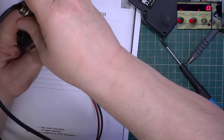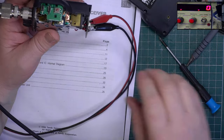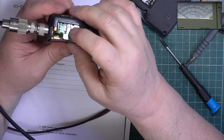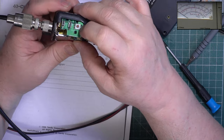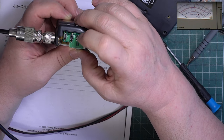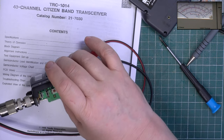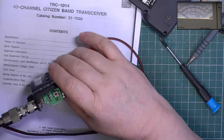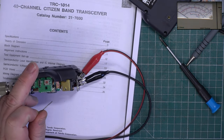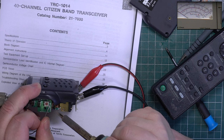I'm not bothered what channel it's on - it's just a matter of trying to see what's happening with the PTT switch. I'll put the picture-in-picture onto the main meter so we can see it going into transmit. You can see I press this and it's pretty intermittent. So I'm going to have to replace that switch by ordering one - and I bet I've got to order 25. So we'll take the power off. I hope to do this on Mr Chippy's bench where there's some finer solder - it's one-millimetre solder on this bench.